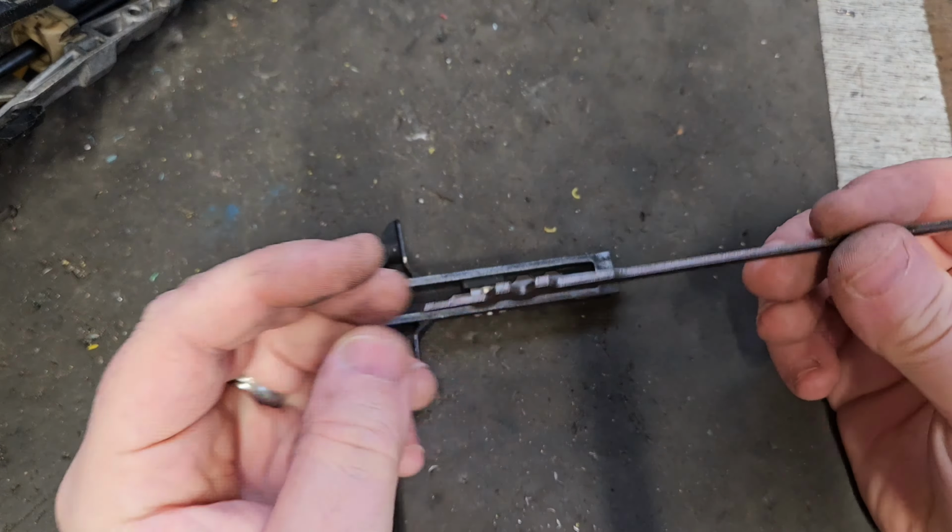When we're in this far, I'm going to clean that wheel with contact cleaner, that little drive wheel that fires the driver forward. What to do now is feed this driver unit onto these 2 long bars and springs there. You see, you have to feed it on, and this channel here in the bottom runs in that pulley wheel there. That's what fires it forward. That's running nicely in that channel now, as you can see. And we just got to put things back together.